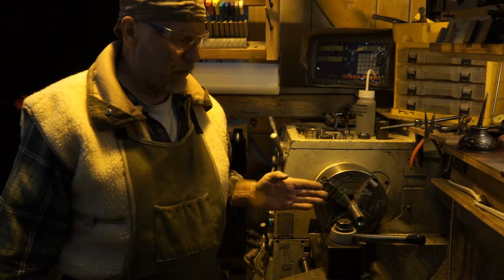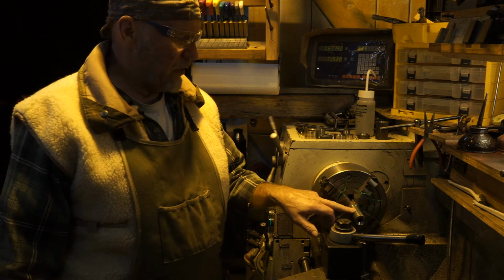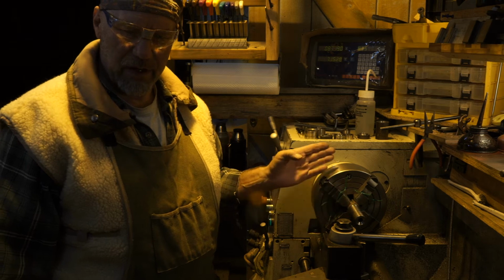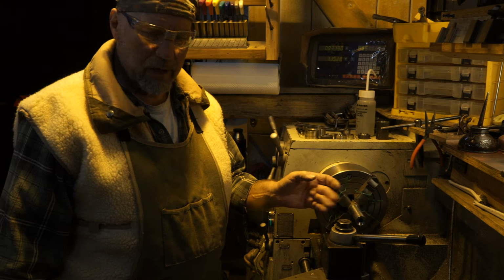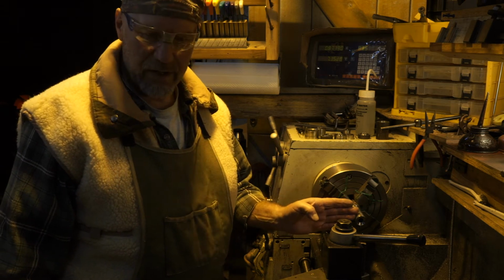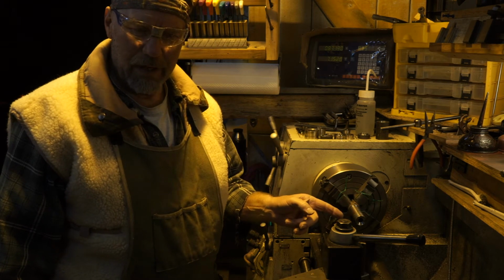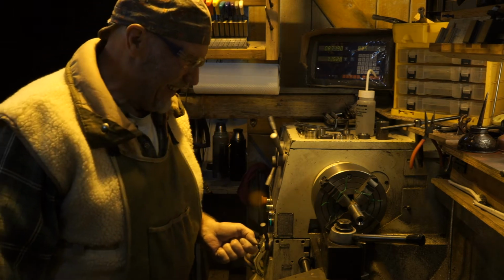I'm going to thread right over the top of that and pretend it didn't happen. It turns out that he turned his tenon. I mean, everything works out to where if I can find these threads, I can just chase them on in, and I can use his chicken out groove to set the threads. And better than that, because I'm whacking an inch off of this tenon, or close to that, I've got a place to hit and bugger it up and pull out.